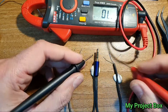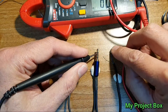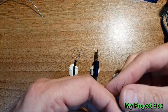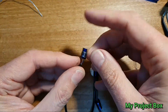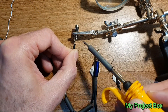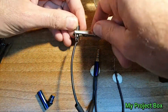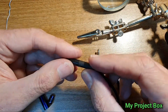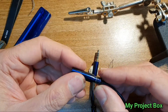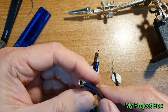Make sure you put your screw caps and heat shrink on the cable first — there's nothing worse than soldering your connections and then having to unsolder them just to put the heat shrink on. Do a quick continuity test to make sure there are no short circuits and that you wired it all correctly, then put the sockets on. I purchased the sockets and jack plug from eBay — it's a very compact type, so you have to use quite thin cables. They're neat and make for a very compact, slim-line splitter. You have to be delicate and make sure it doesn't end up too chunky, because after the heat shrink it all has to still fit together and screw together nicely. With a bit of effort it came out quite nice — I was impressed with the end result.